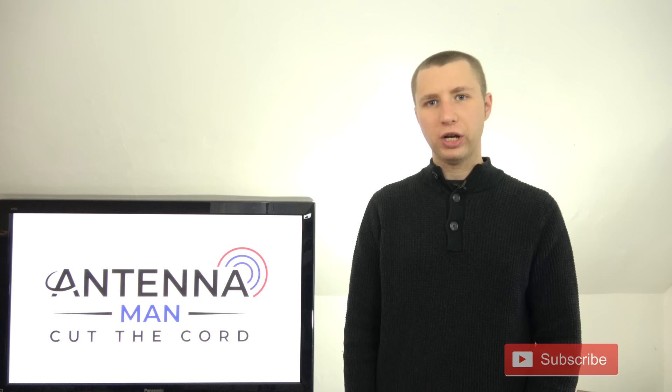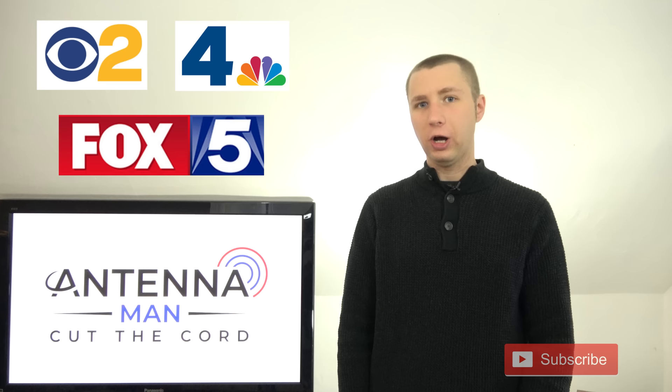It's important to note that most TV stations do not broadcast on the channel they brand themselves under. In New York alone, there's CBS2, NBC4, and Fox5 — so the average person would say channels two, four, and five broadcast on the VHF band, and assume they need a VHF antenna. As it turns out, these TV stations actually broadcast on the UHF band.